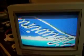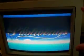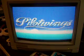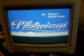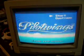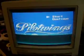Now it's running in PAL 50Hz mode, so you can see top of the screen and the bottom, the black bars. Basically, when these games were first made, they were made for NTSC. NTSC does not have as many scan lines as PAL, and so when they convert the games to PAL, you get those black bars above and below.